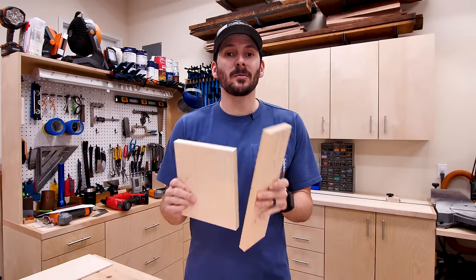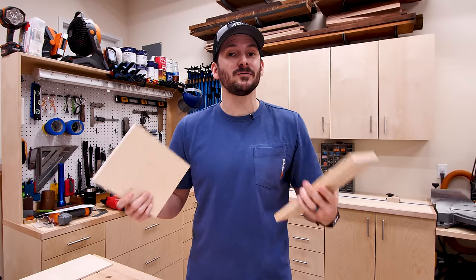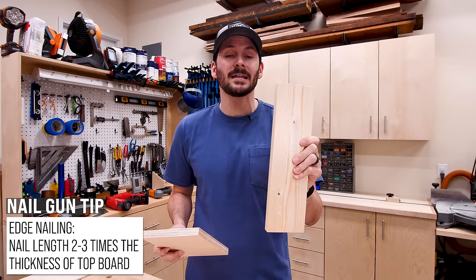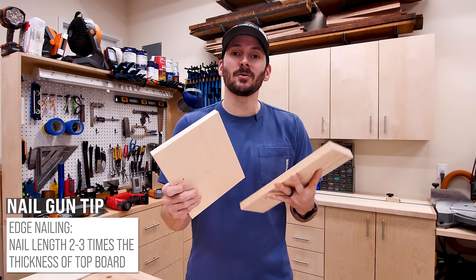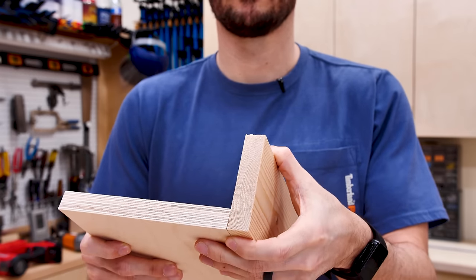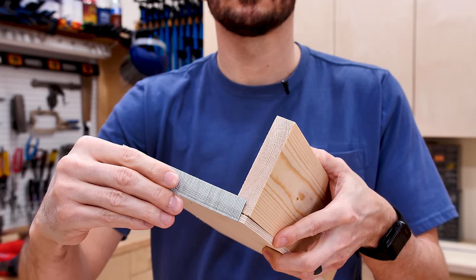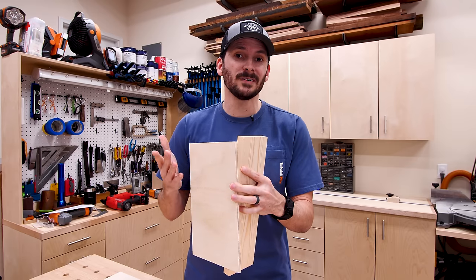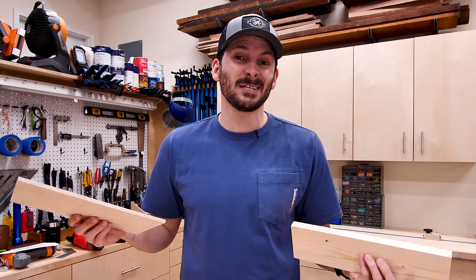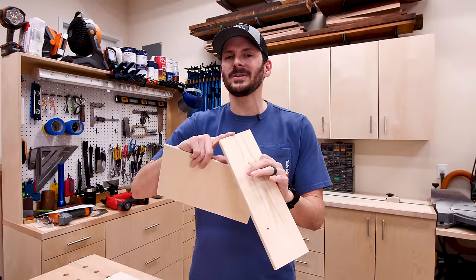When joining a board perpendicular to another board you have a lot more room, because the length of the nail is not going to blow out the back. I like to go two to three times the length of the material I'm attaching. So if I'm joining three quarter inch to three quarter inch material, I'll typically go an inch and a half — giving me a full three quarter inch into the board. But if I'm going quarter inch onto three quarter, going only 2x would be a half inch nail and that wouldn't give a lot of holding power. There I like to go more like 3x and use a three quarter or even a one inch nail. Just don't go way too long, like a two inch nail, because you'll increase the chance of blowing out the side.